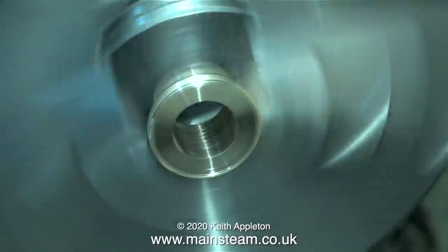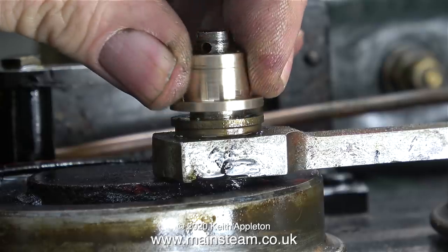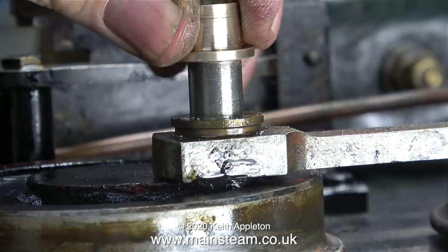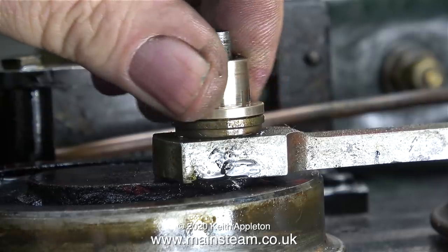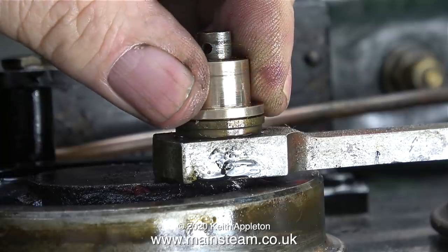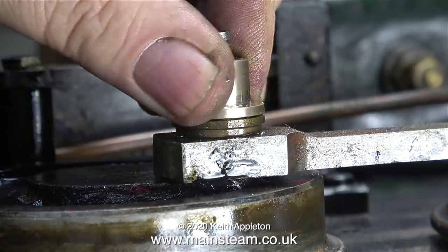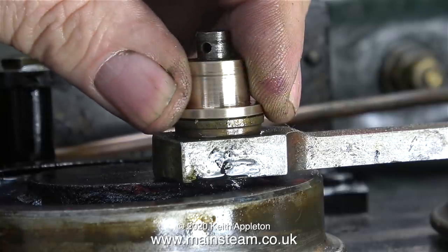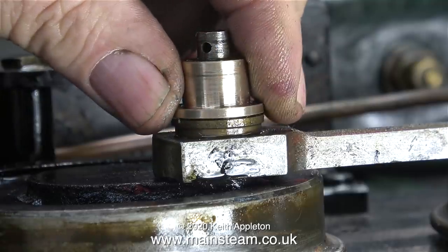I adjusted it and removed the ridge with some emery cloth. Here's the finished bush in place on the crank pin — I'm having a feel at the tolerance, because don't forget the crank pin has worn several thou lower than half an inch. I had an alternative: I could have bored this with a boring tool, machining it to a few thou undersize, but instead I used a reamer. This is why it's very important that the external diameter of this bush is exactly the same as the hole in the connecting rod. In this next clip I'm going to fit the phosphor bronze bush into the hole in the steel connecting rod.